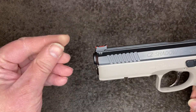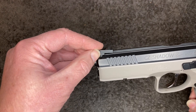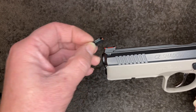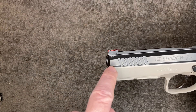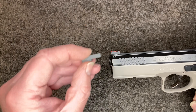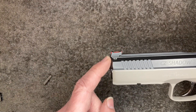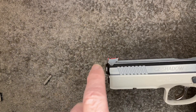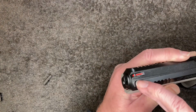For that roll pin — it goes in there, and then the roll pin goes through it. The way that works is normally you've got to drill that. So you put the sight in, and then you drill the hole — or the half hole — through the sight. When you do that, make sure you drill from left to right, so that the rotation of the drill pushes the sight into that dovetail.